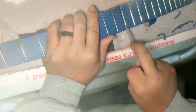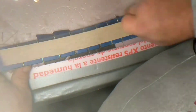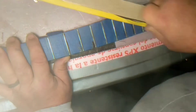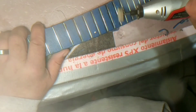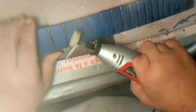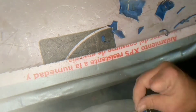Now I take a black marker and cover the fret completely with it. As I sand with my level, any high spots will be sanded off first and you'll see the shiny metal on the frets again. You just work your way down until they're completely level, then put the marker back across and check them again. The second time I used the level, I used 2000 grit for polishing purposes more than taking down any frets, because the first time I used 100 grit and that pretty much took down the frets that I needed.